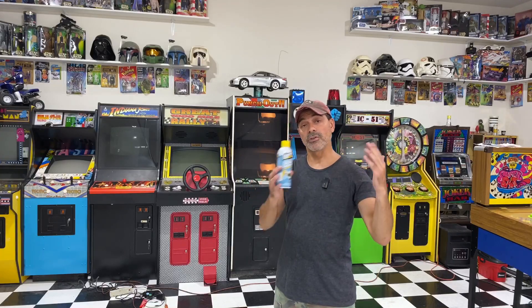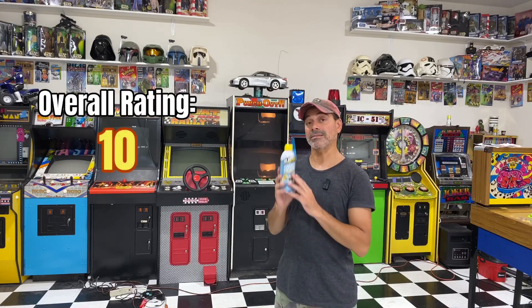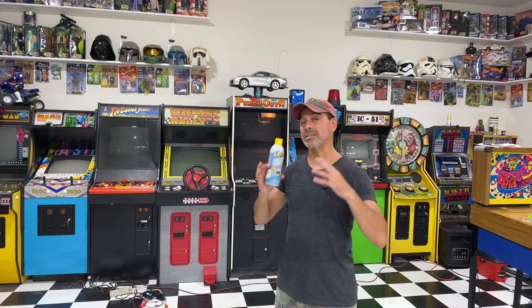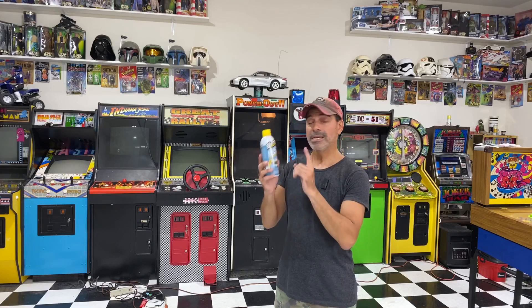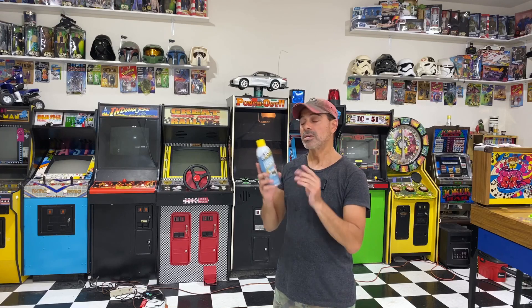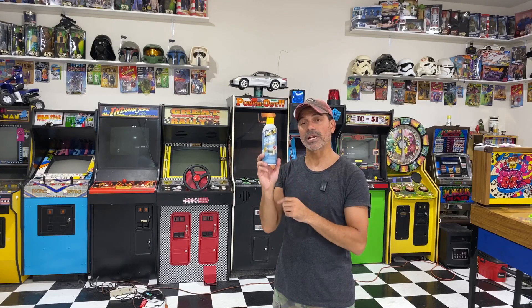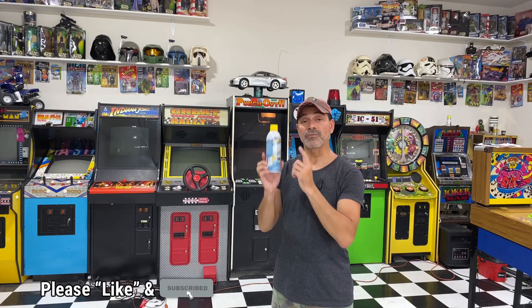So you heard it for yourself — the before and after. To wrap up this product review for this garage door lubricant by Blaster, I'm going to give it a 10 out of 10. You could definitely hear how noisy and squeaky and creaky everything was, and how smooth it was after the application. The key thing is that you apply it to all the mechanisms covered in this video and described on the back of the container. You don't want to skip anything — hit all the hinges, where things are rubbing and bending, the springs — that'll quiet everything down. Highly recommend it; you can pick this up at hardware stores or online, it's not expensive. I hope this video was informative. Please send me any questions and comments, like the video, subscribe to the channel, and I'll see you next time.